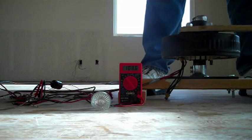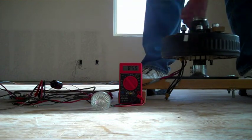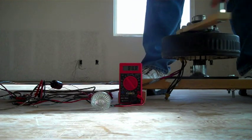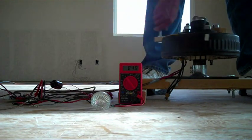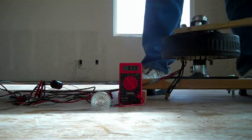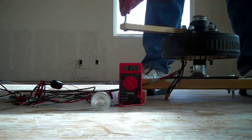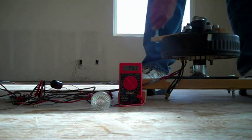Now I've cut my cranking speed by about 30%, simulating a drop in wind speed. The first thing the controller does is remove the load from the turbine so the turbine can spin up. It will eventually track down to the new cranking speed and start withdrawing power from the alternator again. For this prototype and demonstration I've deliberately slowed the control loop down so that it takes some time to track the change in speed.